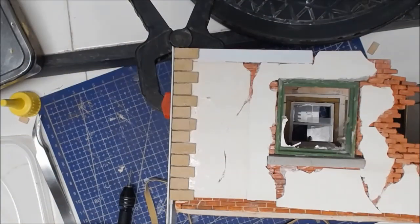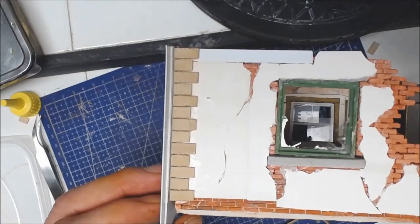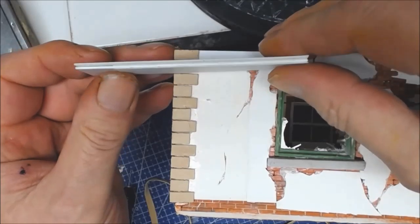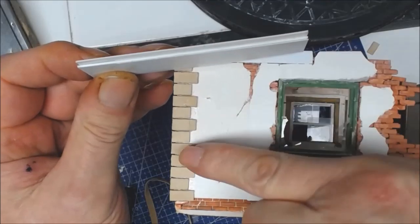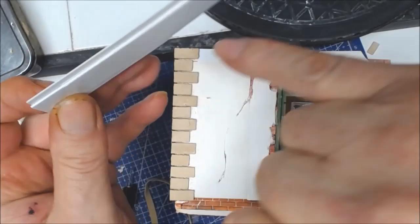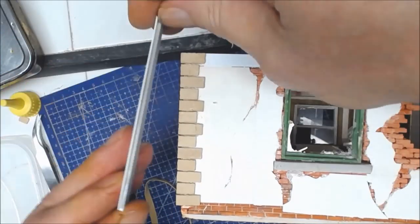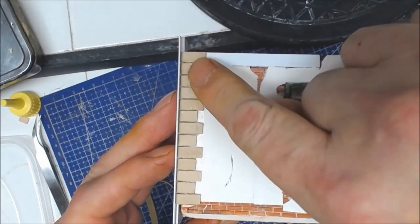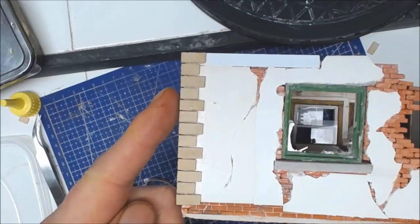Now, to help me and speed things along, what I've actually made is a little profile. If I just unclamp it, all it is is a few bits of scrap styrene. I'll get it into shot. I've just made a little offset the distance that I require the corner blocks to hang over. And also, because it was clamped against the wall there, it also gave me a nice straight line down the edge, so when I come to put the other ones on, they just butt up